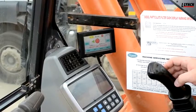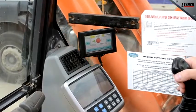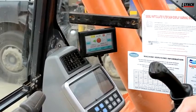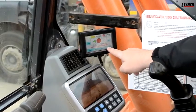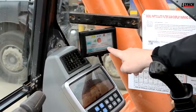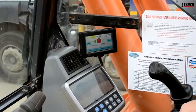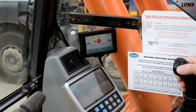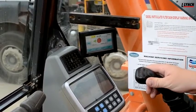To check that it is working you can now also lower the boom to the floor. Do this several times to check that the system is in place and operational. To cancel the height restrictor, go to the bottom right hand corner of the screen and push limit. Hold this button for three buzzes. This now means that the height restrictor has been deactivated. You can check this by trying to raise and lower the boom. As you can see, the height restrictor has now been disabled and you are ready for normal machine operation.